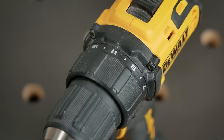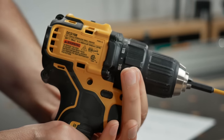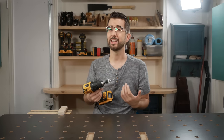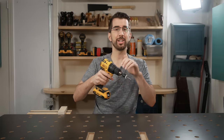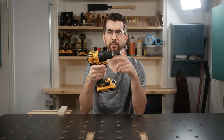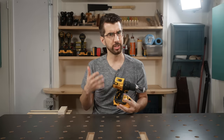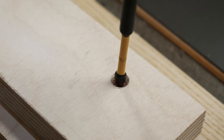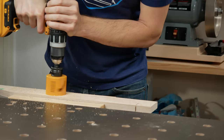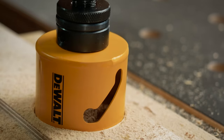I think the most useful part you get with a drill is the clutch. This makes the drill stop turning when it's reached a certain pressure or torque. I can set the clutch really low and just grab onto the chuck and the clutch just lets go and stops spinning, even though my finger is still on the trigger. This allows you to drive a screw and the drill will stop the screw threads from stripping out in the wood and just doing the spin of death. If you're using a large hole saw, you can use the clutch to prevent you from breaking your wrists if it binds up.